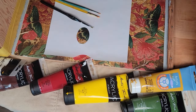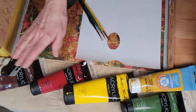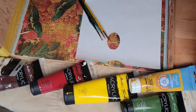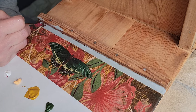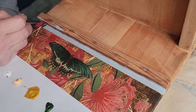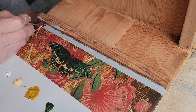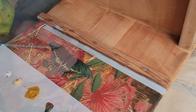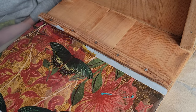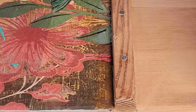Now I need to paint in that top area and the bottom area with my paint. I have my painter's brushes and I have the colors picked out that I think I'm going to need. Start on one end and concentrate on the color and the pattern. Match your color. Match your pattern. And if you can't quite get that color matched up, just take your color up into the paper a little bit — that kind of fools the eye. Looking pretty good, but disaster's coming shortly.